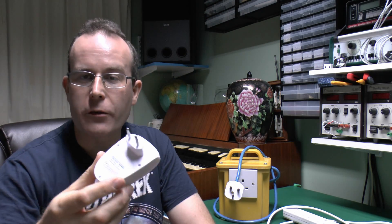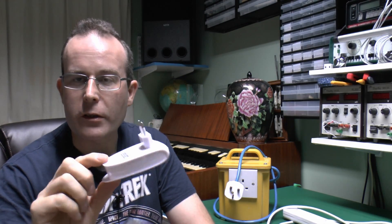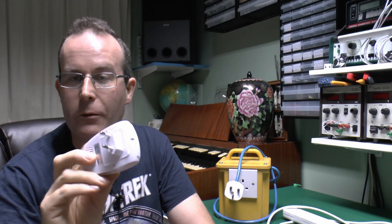And of course the insides are going to be pretty much the same as this one. Another comment was about the test done with the oscilloscope and the fact that an isolating transformer must have been used — well yes, sure it was. Here is the transformer in question. For those that don't know, if you attempt to connect an oscilloscope to a circuit which is connected to the mains, there's a very good chance of something blowing up, because the input to the oscilloscope — or at least the outer grounded part of it — is connected to the mains ground. So if you connect that black clip lead to something in your device, you're effectively connecting that to mains ground, with a very good chance of shorting out the mains and creating a large explosion, destroying the device and the oscilloscope and anyone in the vicinity. So if you are going to be doing that, an isolating transformer is absolutely essential. And this was obviously used in the previous demonstration.